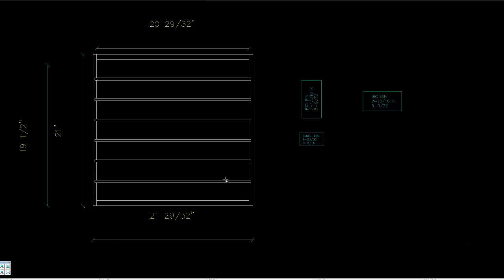And what you see going across horizontally are the removable dividers. I've designed the location of these dividers based on these plastic bins that I'm going to order for you. It worked out pretty good. I decided to use 3/4 inch material on the front and the back of the drawer box to help me along with my assembly, and 1/2 inch material for the sides and the bottom of the drawer, and 1/4 inch material for the dividers. So if you want to use some of these bins in one of these drawers, you're going to remove the unnecessary dividers.